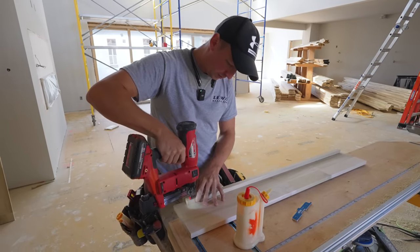The trickiest part of building this is that your measurements have to be absolutely perfect. If you cut things too long and force them in, when you go to put your one-by-six in it'll be too tight. If measurements are too short, you'll have gaps along the side that won't look good. Visualize this blocking up on the ceiling — we're nailing the one-by-eights onto the side. The trick is to have the top of the one-by-eight about a quarter-inch low so you can just float these across the ceiling without having to scribe them. A piece of trim on top will cover the gap between the top of the one-by-eight and the ceiling.